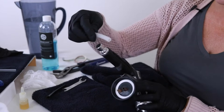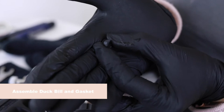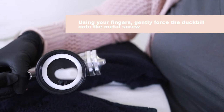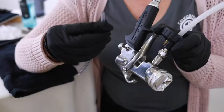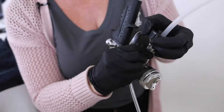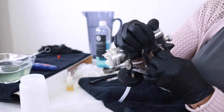The next piece we're going to assemble is the duck bill. Here's the duck bill — this one is still salvageable, you can still move it with ease, so we can use the one that we already had. Just put it back on that screw and then the little gasket goes next. Use two fingers to push that thing and secure it on. Now we need to put our air feed tube on. We're going to wiggle it on — try to get a little piece on and then wiggle back and forth. You want to wiggle it on until there's one or zero threads showing. Then we'll do the top piece — again wiggle and push at the same time until zero threads are showing.